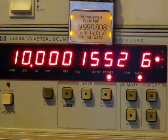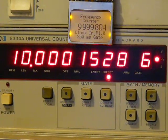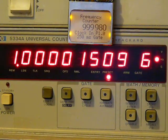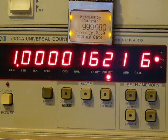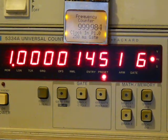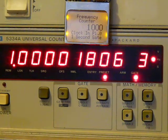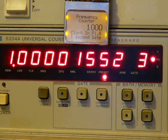So let's try some other frequencies. Moving down to 1 MHz. Again, one's a little low, one's a little high, but they're both generally correct. Now you notice the MSP430 counter has switched to a 1 second gate time, and it'll do that a little under 1 MHz.